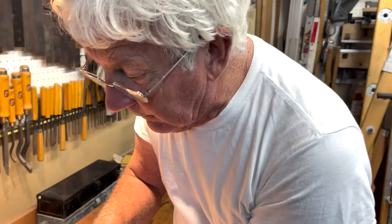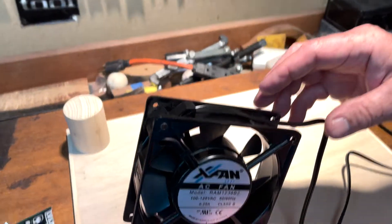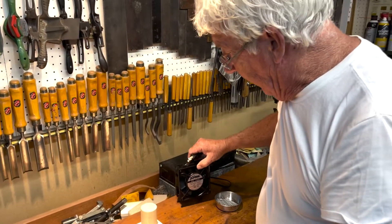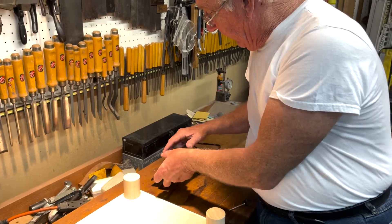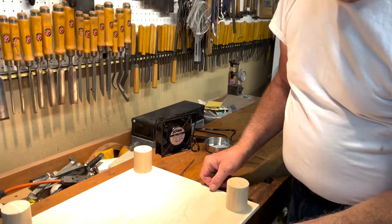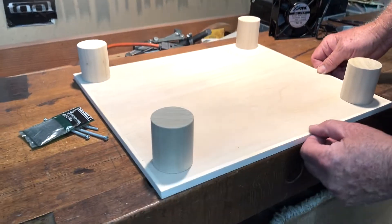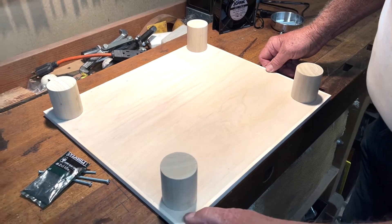When they sell these fans there's just an extra plug-in wire, and you can get them either 12-volt or 110-volt — I've got the 110-volt because I like to plug it in. The platform is cut from half-inch plywood, and I used clear pine that I ripped out of a three-quarter-inch board and then ripped again so it would fit the half-inch plywood.